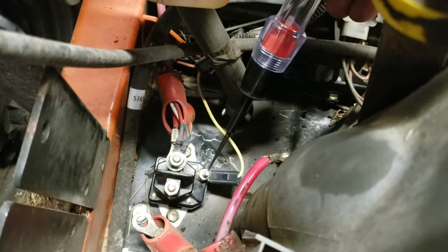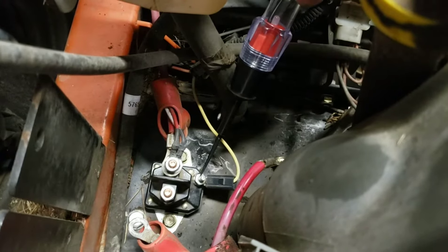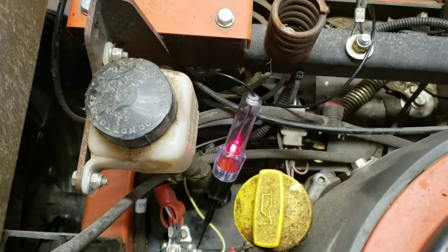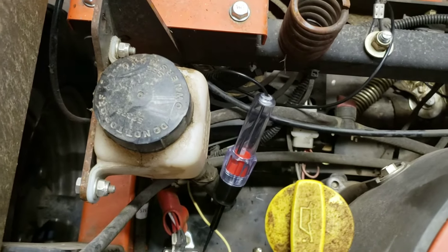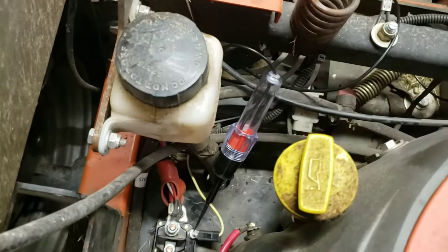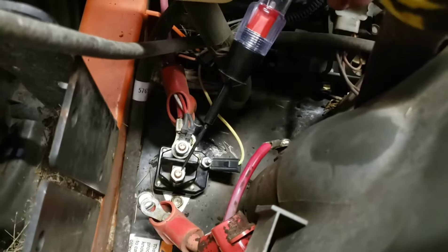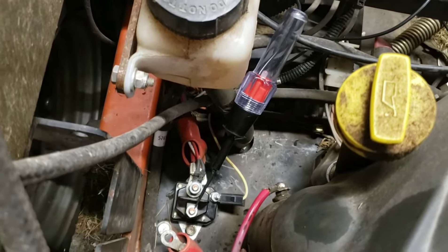But I want to show you what I was talking about with the safeties too. Let's say it were a safety — as you can see it's still set up like it was, but let's pull this handle back. I bet I get no red light — and nothing — because it broke that circuit with one of those safeties. I put it back in its position and I have it again. So I'm going to pull this solenoid out and go find a new one.